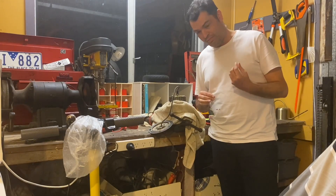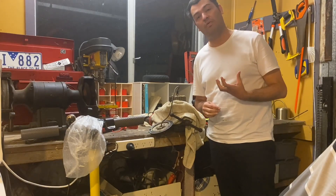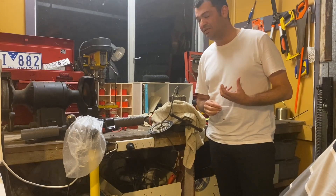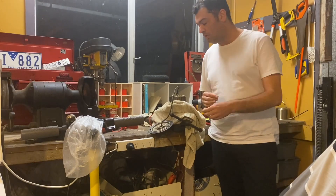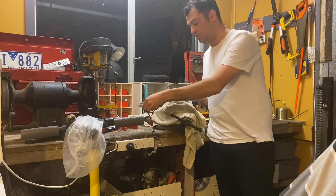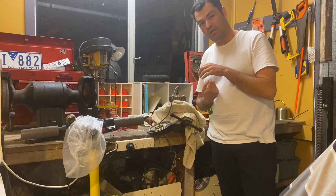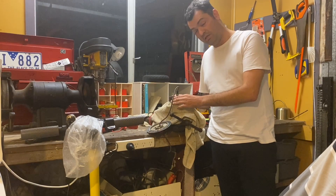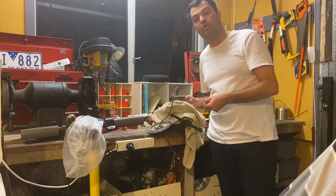We've all probably taken apart our M365 front wheel hub assembly before when changing that awful tire, which is almost impossible to change, so I'm not going to go through that. Basically once the motor is off, all you need to do is undo the screws on it, then get a suitable driver, put it on the back side of the stator assembly, and push the side of the motor down along with the tire. You don't need to take the tire off.